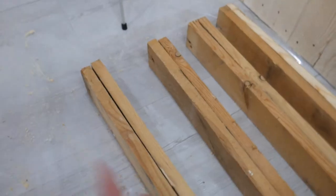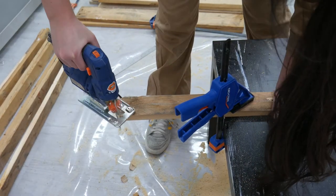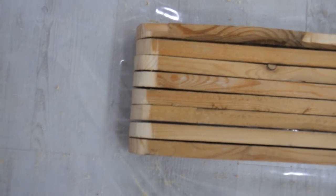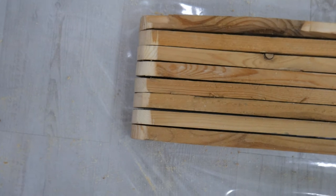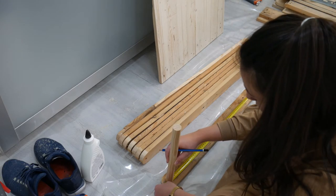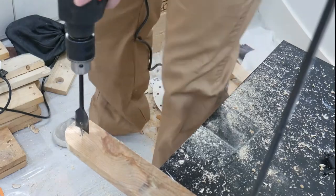I used 6-centimeter width boards cut to length — you'll need eight pieces in total. At this point I also rounded both the top and bottom ends using a lid as a reference, to ensure the table is stable. The pieces should be perfectly aligned on one side; choose the side that matches best for the bottom of the legs so it won't wobble. You'll end up with eight equal pieces that are paired and glued to form the four legs. First, drill the holes that will connect the four legs into the shape that gives the table its ability to fold away.